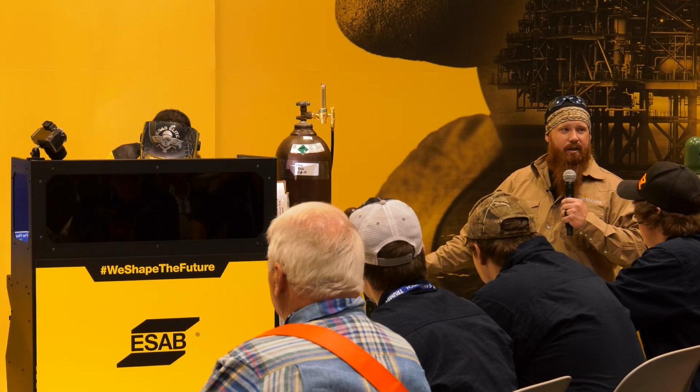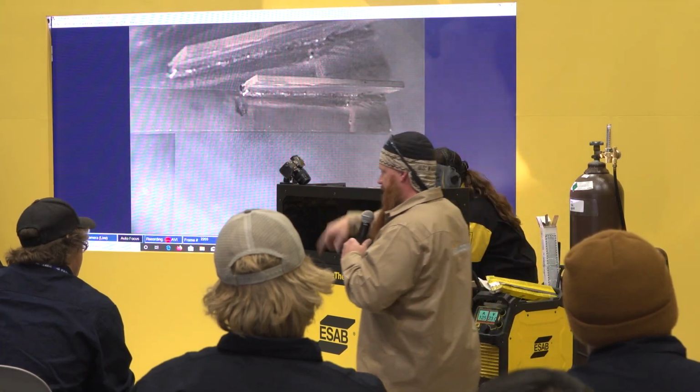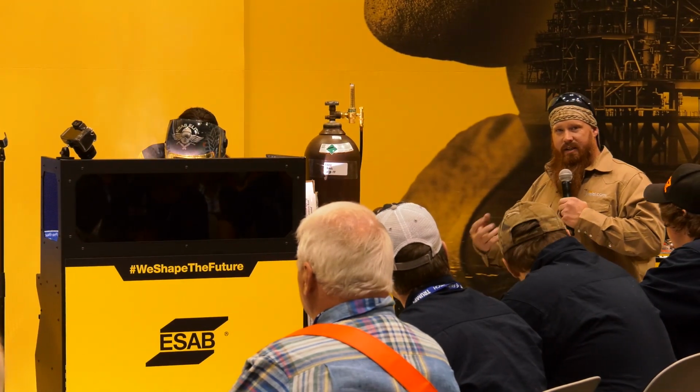You hear the difference, you hear how it's a lot more choppy. It's not as smooth as it was before. That choppiness right there, I could walk down in a bay of 10 welding booths and say that individual behind that curtain is not running the right polarity. I've been able to do it on job sites. You should be able to identify that sound. It's a very distinct sound.